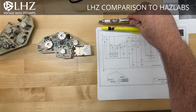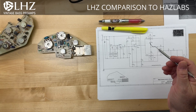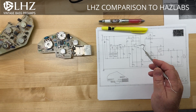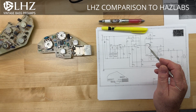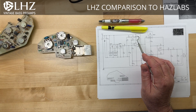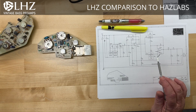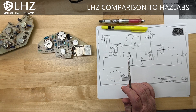If there are any changes on the schematic, I'll go ahead and make notes on there of what may be different. The intention is that each time I trace one of these lines — let's say I'm starting with pin 7 on the op-amp — I'm going to expect that the same number of components are physically connected by a trace. Looking on the schematic, I'll expect to see it touching a 10PF capacitor, a 51K resistor, a 12K resistor, and a 20K resistor. If there's anything else, then I've missed something on the board. It's pretty straightforward.